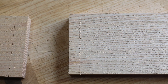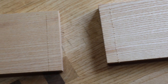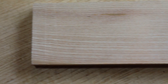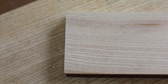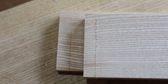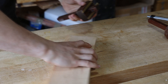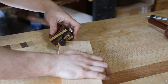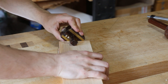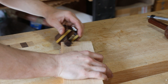Using light pressure and referencing it off the marking gauge itself, that line is looking really good. Going through these samples: that is the result of too much pressure going in perpendicular to the wood; that is reducing the pressure but still going in perpendicular; and this is what happens when you angle the marking gauge to go in at a shallower angle of attack and also reduce the pressure. It's quite a stark difference - you can see which one's going to be easier to work to later on. And if you prefer to push the marking gauge away from you, you just tilt it away from you and push it like that.